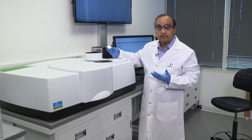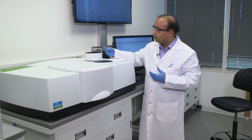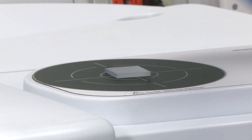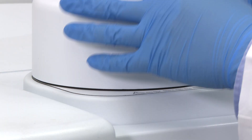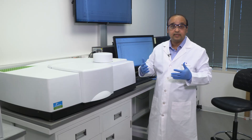Typically the URA is used for specular samples — shown here is a standard well-polished mirror. We simply place the sample on the top part of the URA and place a cover on top of it. In this configuration, the software is capable of measuring specular reflectance coming off the sample.